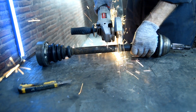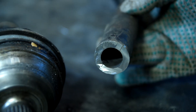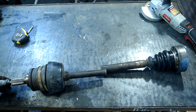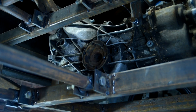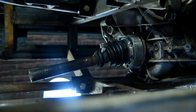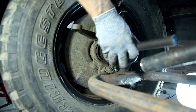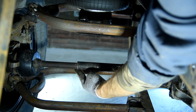After that I'll connect the drives to each other. It'd be perfect if the drive rods could be inserted into one another but not this time. There'll be a collaboration: an internal driveshaft from Audi and an external one from Chevrolet. We need to screw the drive shafts into their places and measure the rods, and only then weld them together. It's very important to adjust the length correctly, otherwise the driveshaft can break either the gearbox or any of the bearings involved in the process of moment transfer to the wheel.